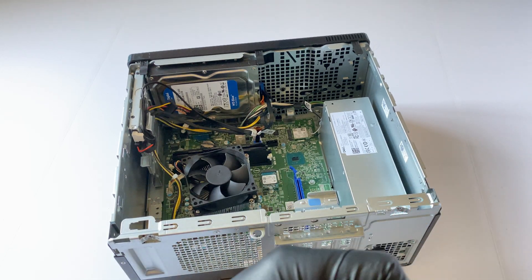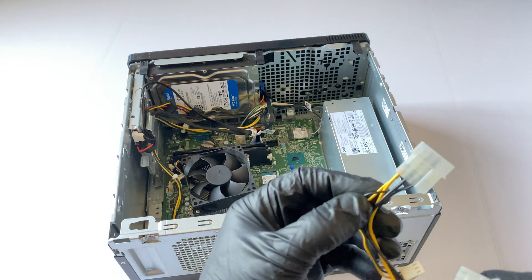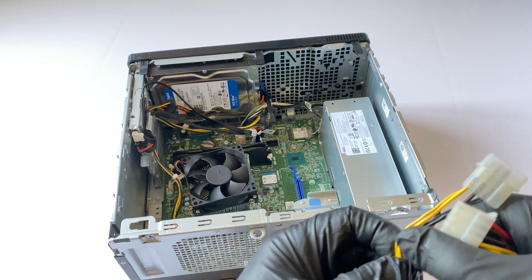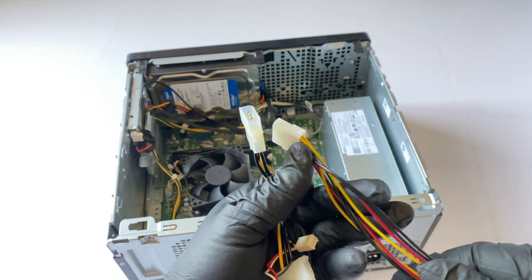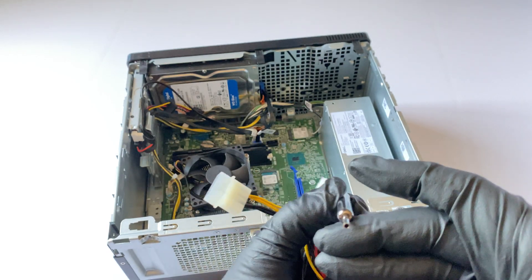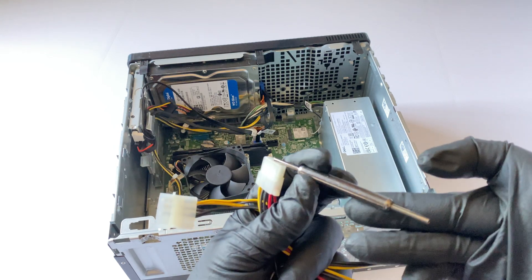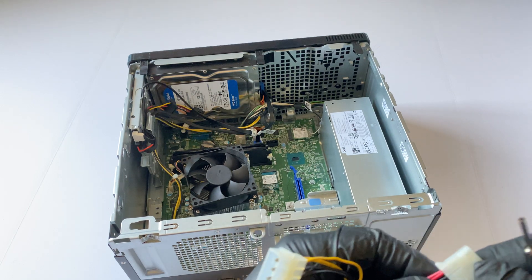The problem is it's going to run very loud. See right here — black is negative, yellow is positive, and yellow is 12 volt. I need to switch it to 5 volt. To do that, you have to use this pin molex remover — they sell it on Amazon. I got this one a long time ago, like in 2007.